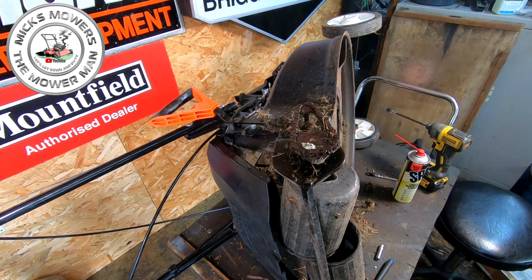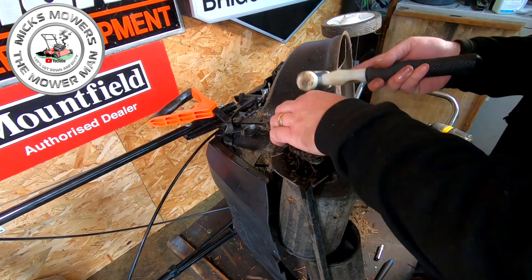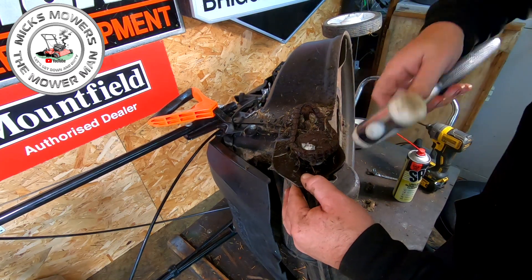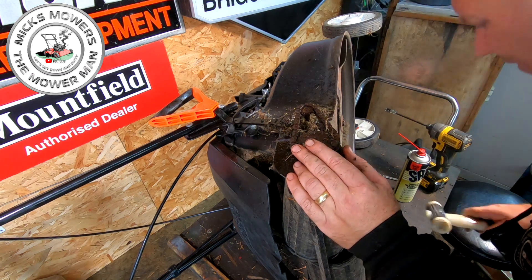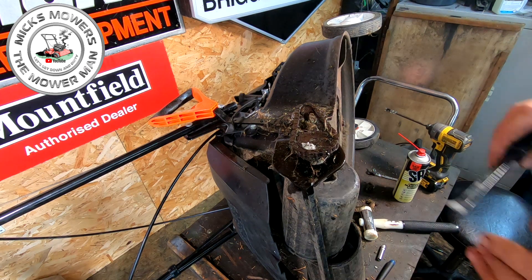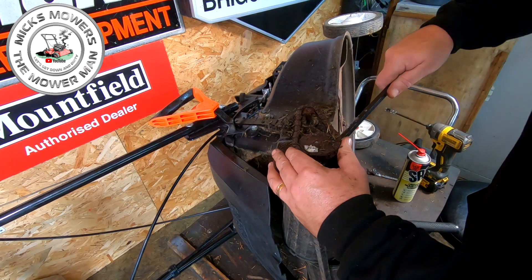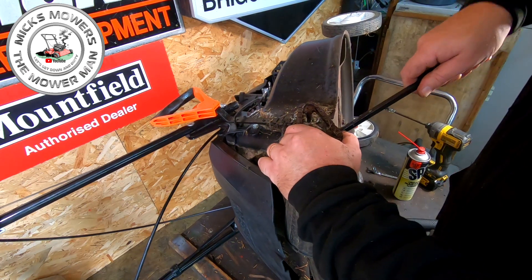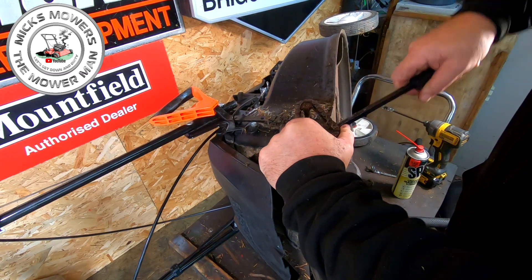It's just the roll assembly that's actually broken; I think the rest will be alright once we find the belt for that and put it back on. I think that'll all be alright because this is just driven off of the gearbox. So, soft blow hammer — not nothing too boisterous — a bit of tapping. Loosen that chain up a touch, take some tension off, just to try and get something to move because it is absolutely solid. I would say that just pops off of there, but I've got a sneaky feeling it ain't going to give its secret up quite so easily. I'll get a little pry bar. That one is moving — you can feel it rocking. Yes, there it goes, so that's come off.